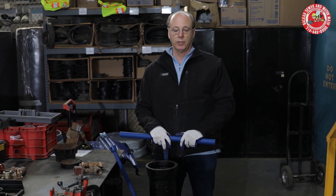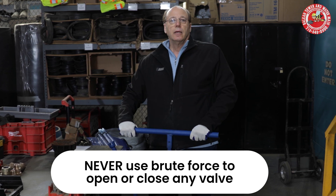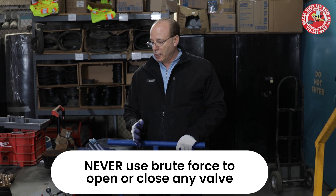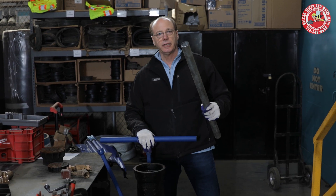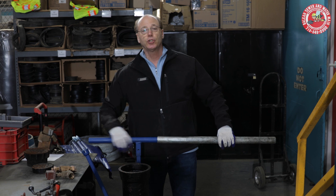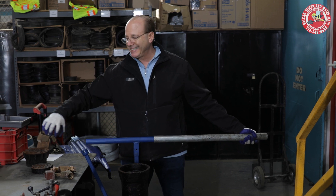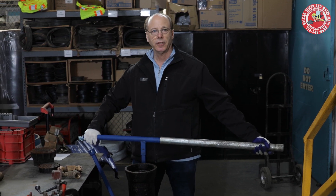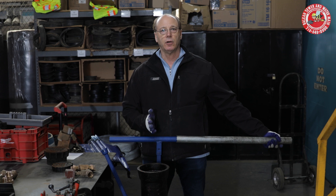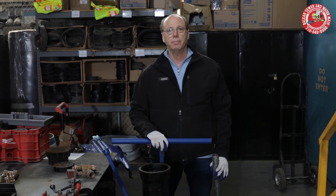The last way people get into trouble: they put the key in the box and it's tight and they jerk it. That frequently results in leaks because you're jerking the valve and possibly the fittings down there. What you really want to do is get an extension on the handle — a helper. If you're having to jerk the handle, you need leverage. Gently turn it to get it moving and gently close it. If you exert force, you can snap the stem on the valve, leaving you with no water or an inoperable curb valve, and then you have to do a fairly major repair.